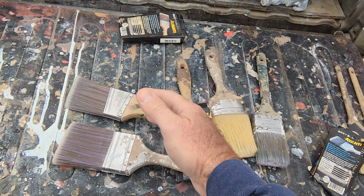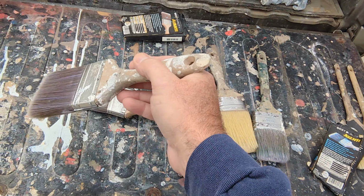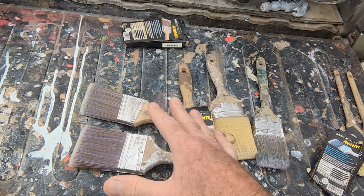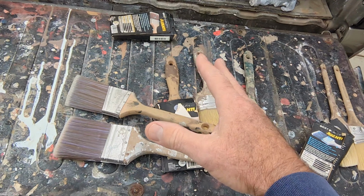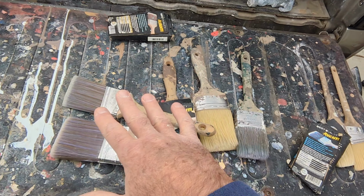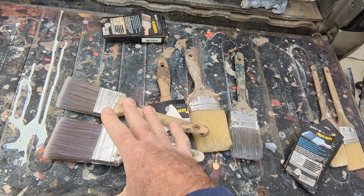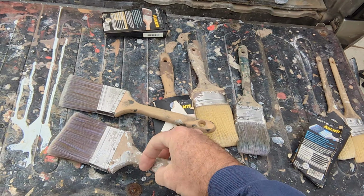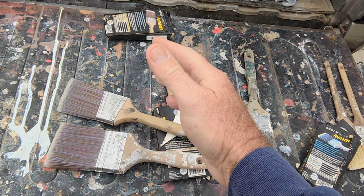which is another thing that'll slow you down because you've got a weenie roller and a brush in your bucket. That slows you down. If you have just a brush in your bucket, you're going to be a lot faster than if you have a Slim Jim and all this. It's like the tin can man, the one-man band walking around with all your tools. It's much easier if you have just one tool. There's times when you need to do that, but not all the time. So if you can learn to use one of these, you're going to be faster. You just will. It just takes practice.